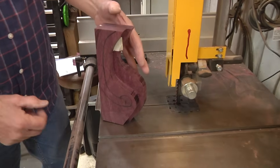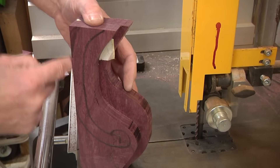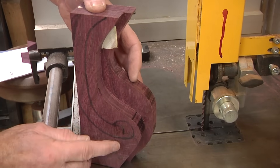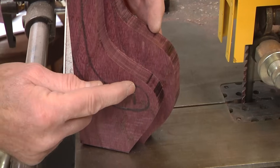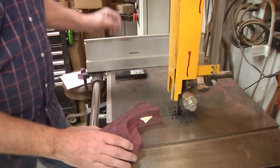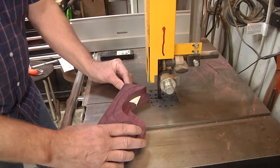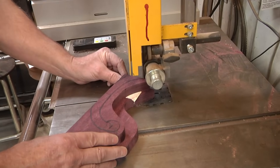So now we're going to be doing some woodworking. I've doubled up the wood like I did before. I've drawn a shape on here — this is the outermost, which lines up with the outside of my top piece. As I come down here, there's my center line. Make sure this goes a little bit further than the center line so that when you put your attachment here, it's dead center on the tops and the bottoms — that helps out a lot. You can make this any shape you want — I'm going for this coat hook look. Since it's doubled up, they're going to be identical, and that's the whole idea. My blade might not make this curve, so I might have to do a couple tries.